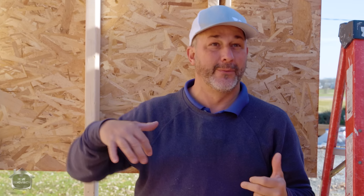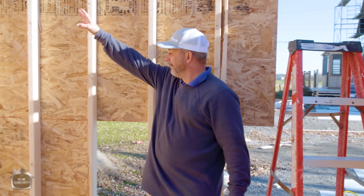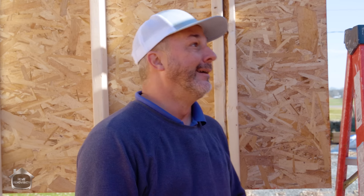Let's just recap. We've got everything framed — we've got an 8'3 structure using stock lumber basically. We have a cross brace in the middle to hold it from bowing. We've got our sheathing on to keep everything from shifting. Once you get all those nails on the body of a sheet of plywood, the frame can't twist one way or another. In the old days they'd actually put a brace on an angle as part of the framing. But if you're using sheathing, you don't need to add all the extra wood — it gives incredible strength, a nailing surface for your siding, keeps bugs and everything else out, and it's an air barrier. This is just a really quick, advanced technique for building on the cheap side of things.